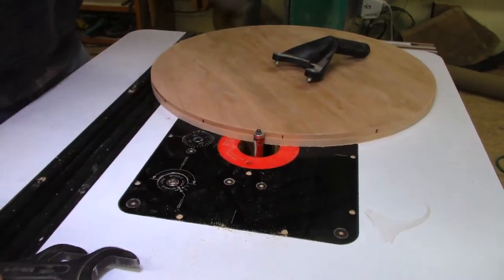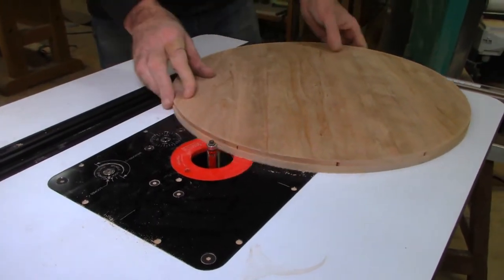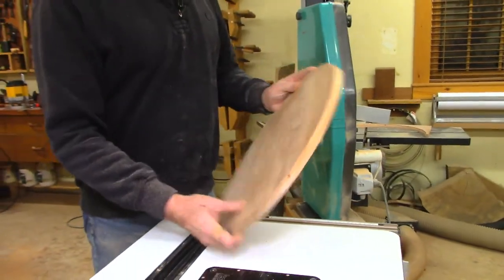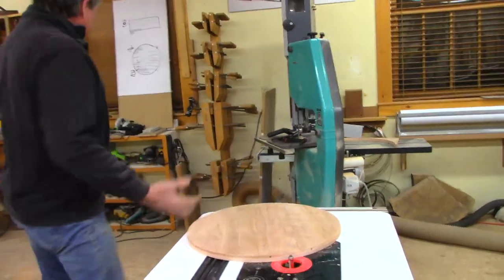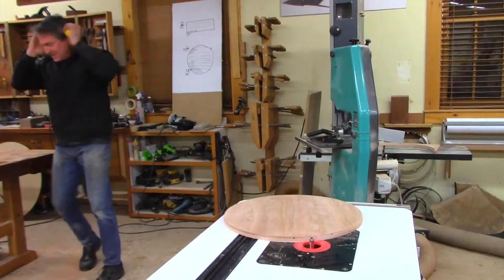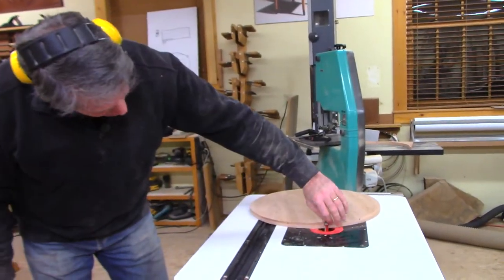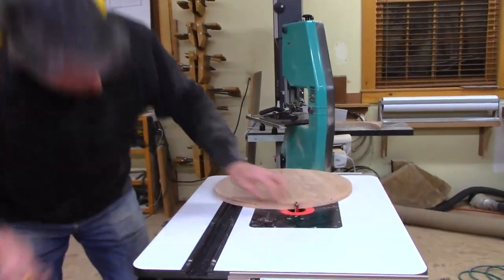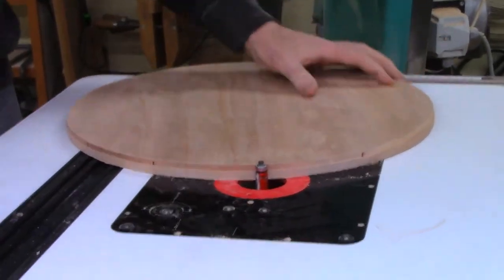Correct. Let me see. I'm not seeing it. Very minimal. The heavier the bit, the bigger the machine, it always works better. But so now I just took a straight cutter, and I'm just going to trim this using the bearing against the flat that I made with the first cut. Let's see how this goes. Let's see if we get any tear out against the grain here.